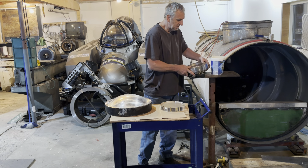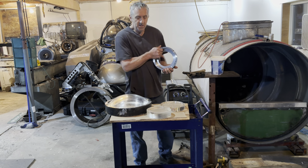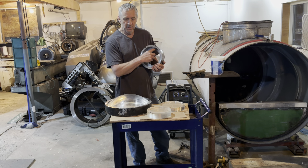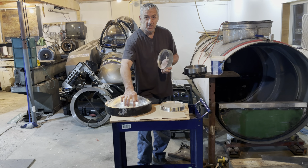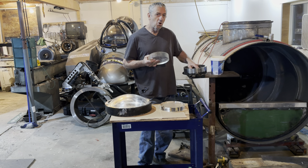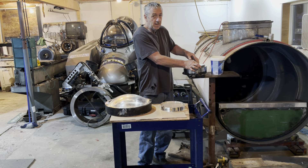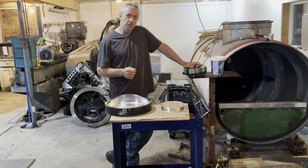People are tempted to put an o-ring on the face of the seat — you're not allowed to do that. The o-ring can be on the side, often down in the corner, where they machine the edge off just like on this conical seat window and the o-ring is squeezed into that. The reason you cannot put the o-ring on the face is it interrupts the load path — the window has to have full contact all the way across. No o-rings in the seat face; that's a big no-no.